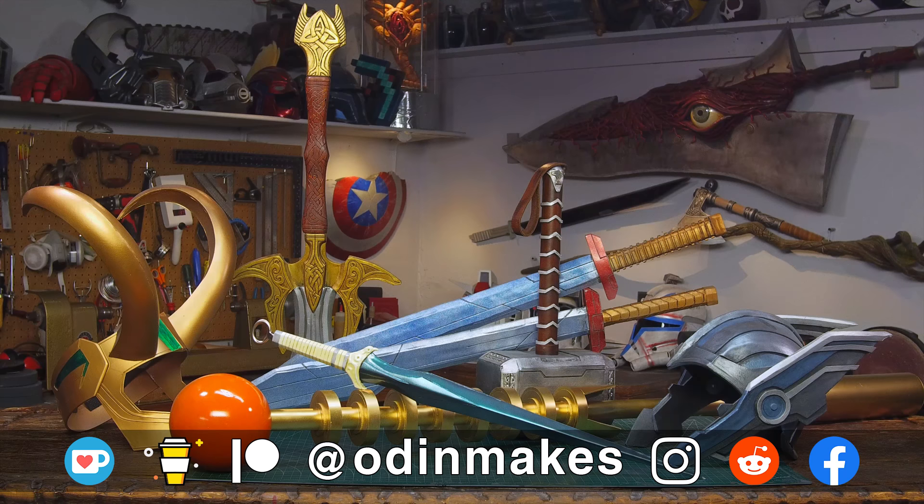I need to drill out the golf club because it tapers ever so slightly on the inside, then I sand the sides of the corkscrew — I just need to remove a little bit because it was only about a millimeter over. There we go, that's a good fit. That's what we want. It can use a little bit of counterbalance, and I just have to make sure I put that in straight when I epoxy it. I'll be upset if it's not straight. Let's glue that in.